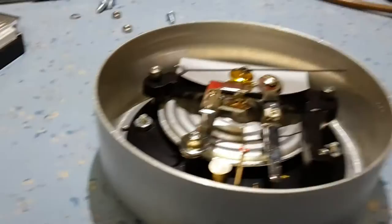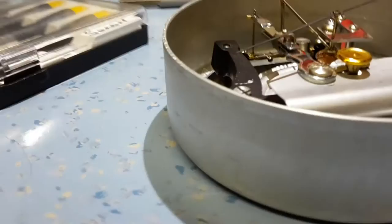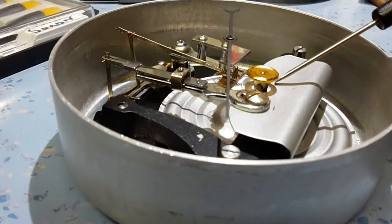That bellows comes through to this point here, and then there's a pin. You can see these two pins here. Pay attention to this spring here — this is a very heavy spring, actually. It's very hard to get these pins back out because you have to put a lot of pressure on there before you can release the pins.